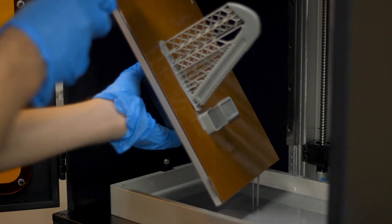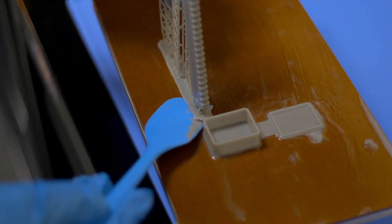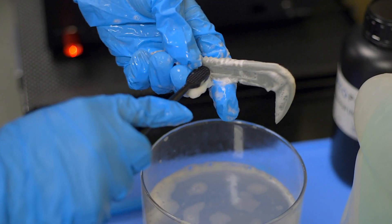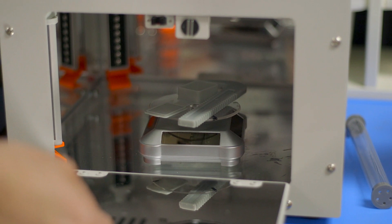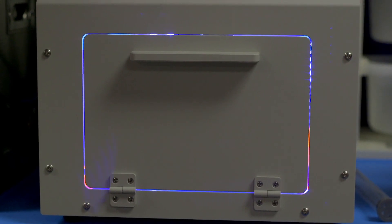Compared to FDM 3D printers, the post-processing is a bit more involved. PPE is required for all steps of post-processing to prevent exposure to the resin. Removing 3D prints from the bed means wiping as much resin off the build plate back into the vat to prevent drips. Use a rubber spatula to carefully pry off the print and dunk it in a bath of ultrasonic cleaning fluid for several minutes to remove the thin layer of uncured resin on the outside of the finished print. Once it's done cleaning, a rinse in tap water and scrubbing with a toothbrush will help break down any remaining particulate and cleaning solution left on the surface. A quick drying cycle with a blast of air from an air compressor, and spending some time in a UV curing station to fully cure the 3D print will prevent it from slowly curing over time and having a gummy surface texture.